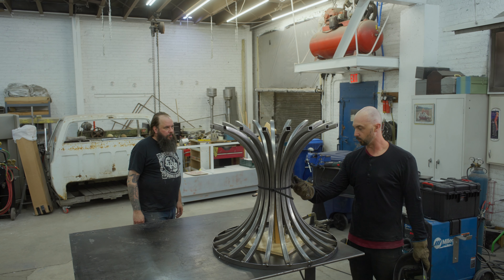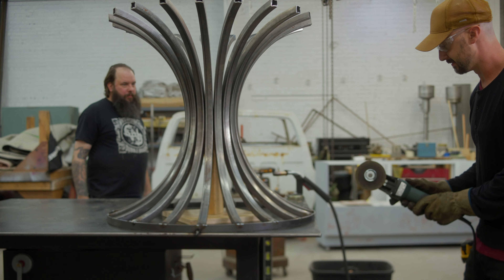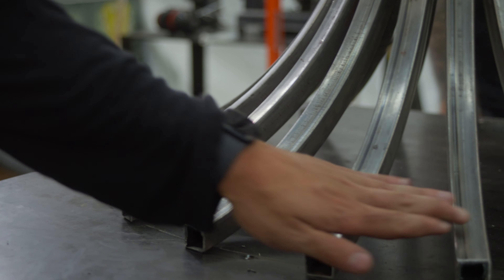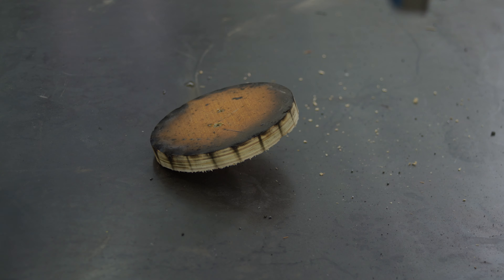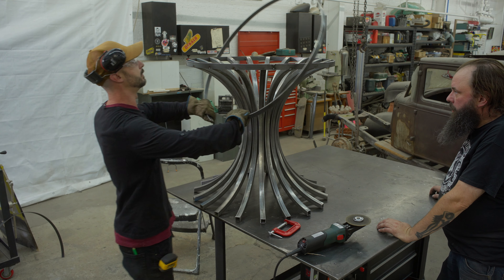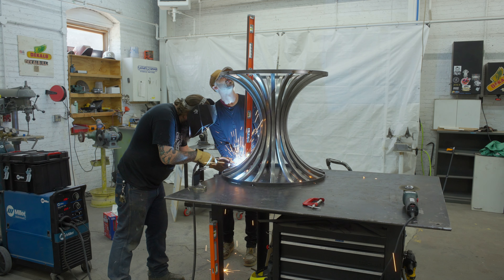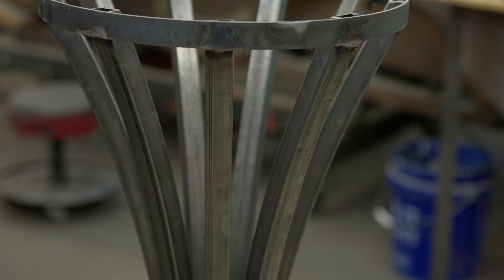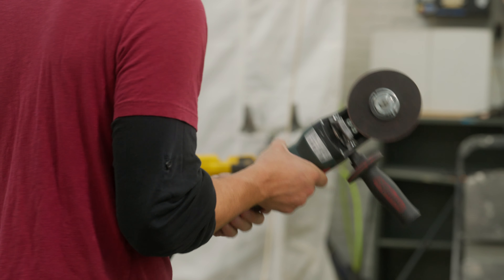We welded the same on the bottom half as well, just to make it a little stronger. Now that the legs weren't going anywhere, we cut the tacks connecting the base ring to the metal table, which allowed us to flip the leg over to make another circle for the top ring. The stem I made to hold the structure together took longer than I care to share to remove, but it eventually popped out. I checked for level and it was indeed level — that made me very happy. We repeated the same process for the high-top legs; the only difference was fewer pieces of bent metal and the pieces were just longer.